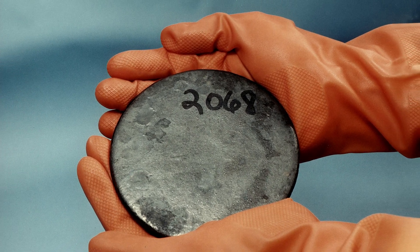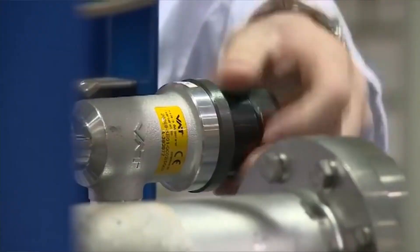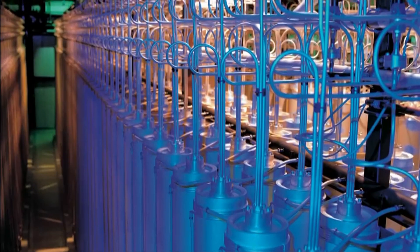This piece of uranium was bought on eBay - it could be a fake, though when I open the lid all the cameras go off, so who knows. This is typical of what's found naturally: uranium 238 with less than 1% uranium 235. Both are radioactive with an extremely long half-life, meaning they're still around from when the earth was first created. Reactors require a little more uranium 235 than is found naturally, since uranium 238 can't support a chain reaction whereas uranium 235 can. Through a process called enrichment, we can get the uranium 235 content up to about three to five percent, which is enough to use as nuclear fuel.